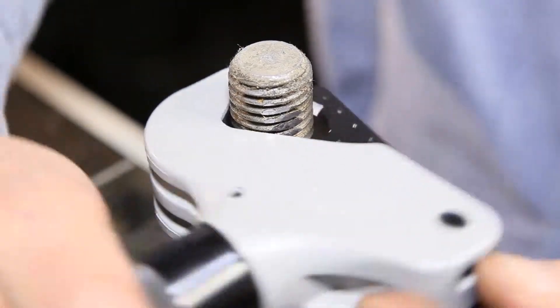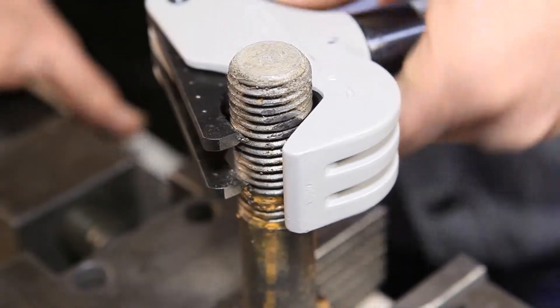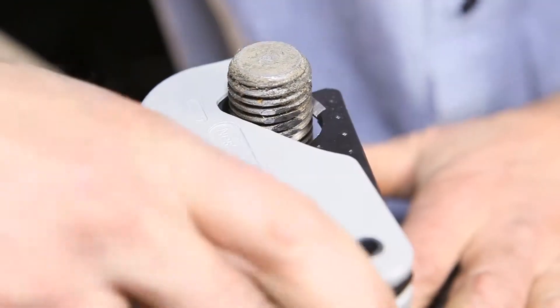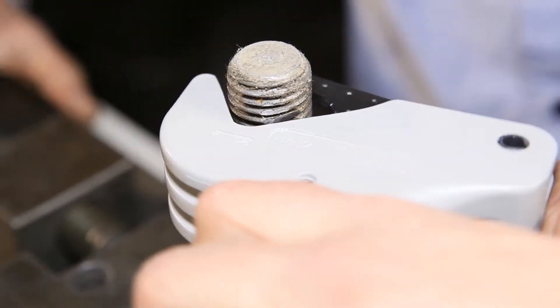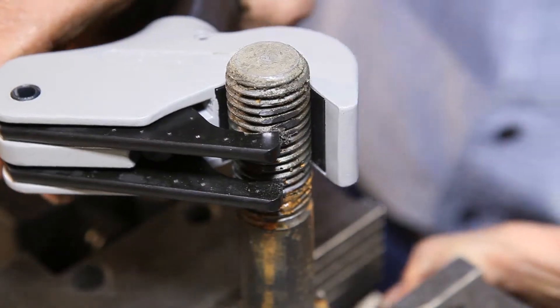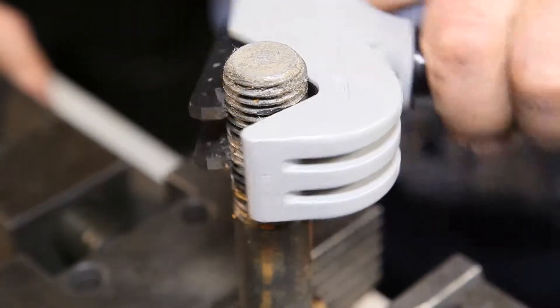The blades float to the correct pitch. Once the tool fits into the thread slot, begin repairing the threads by simply rotating the tool. Both external and internal tools come equipped with blades made from hardened HSS metal. The hardness of the external blade is 58 Rockwell C while the internal is 62 Rockwell C.